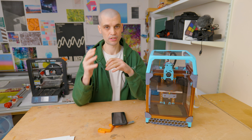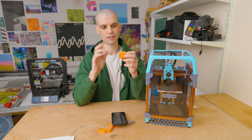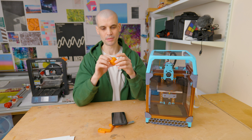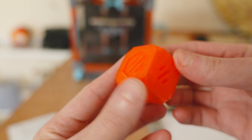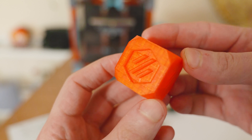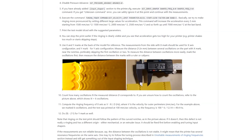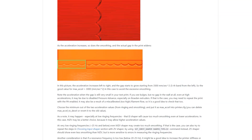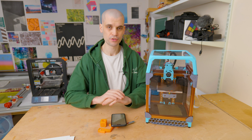I'm pretty sure I could get it even closer to 30 × 30 × 30, but within 0.1mm is fine for me at the moment. The surface finish could probably be improved with some tweaking to the movement and inertia compensation — that's more advanced calibration I may get to at some stage. But for me, I'm using this really for functional parts and I'm not too bothered about aesthetics. Perfect — can't really complain.